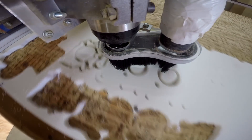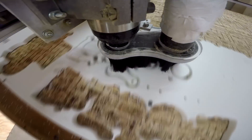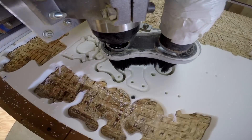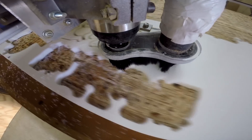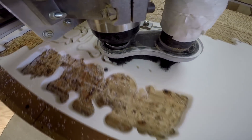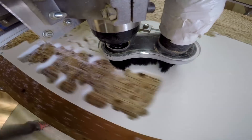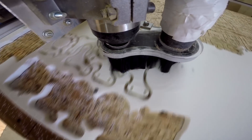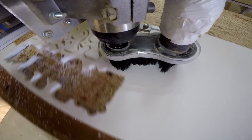That other piece that was messed up can be run independently again after we figured out how to place those holding tabs. In some cases, if it's impossible to machine it, you might have to go to a down-shear or down-cut bit, or you might have to redesign the part. In most cases, we've never really had to redesign for machining — only if there's a post-process operation we can't reach. Usually you can solve those problems with holding tabs. Another option would be a vacuum table.